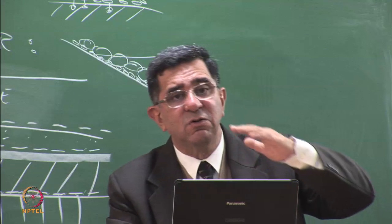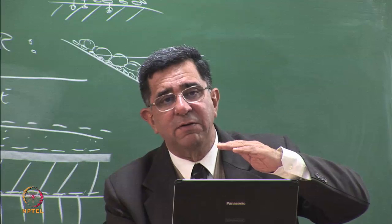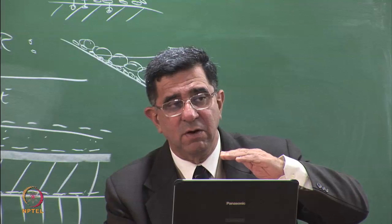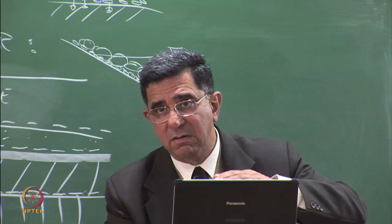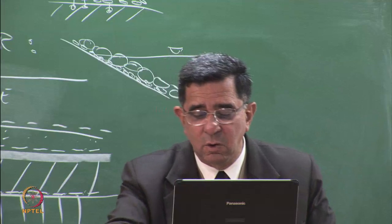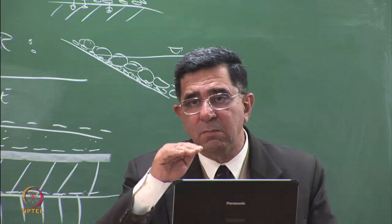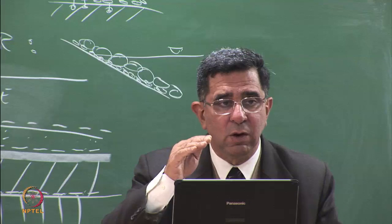Well, in sands, you can use relatively thick layers. If you are using a vibratory roller, you can probably use even 60 centimeters thick, 45 to 60. But in clays, you can't. So, you typically are dealing with lower thicknesses. So, at least 3 to 4 layers of compacted clay, each 0.2 to 0.25 meters thick, properly bonded. Properly bonded means there should be fusion between the old layer and the new layer.